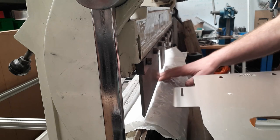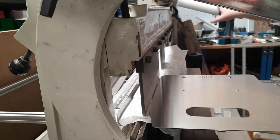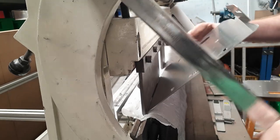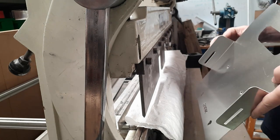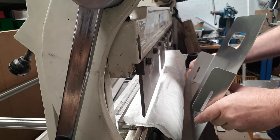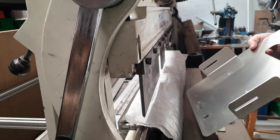Got the plastic in, got my part in, I'll make sure it's the right way up. Put it in — the first one is to just bend that side, so I'll push it back so it's touching the fence. Now I have the first two bends in that particular model. A quick look — that one could do just a touch more, been a bit light. Visually it's roughly 45 looking down the body, so I'll quickly get these done and come back when they're all made up.